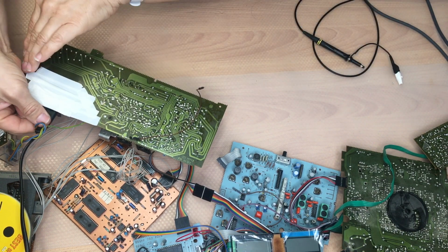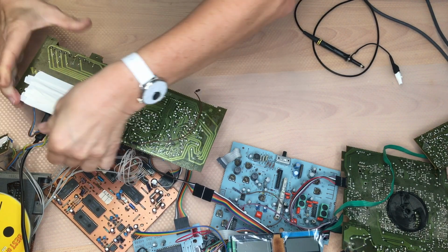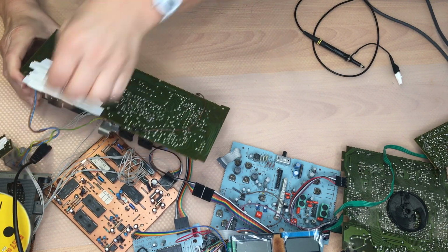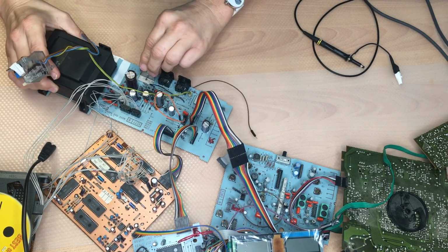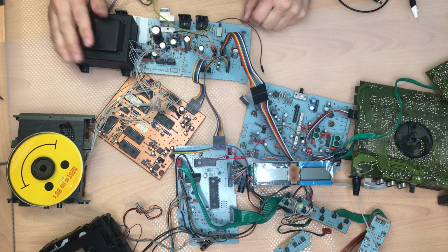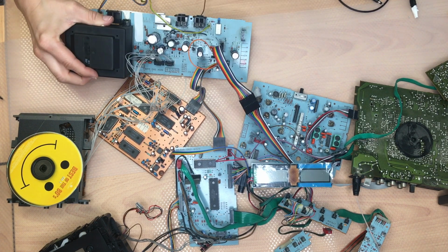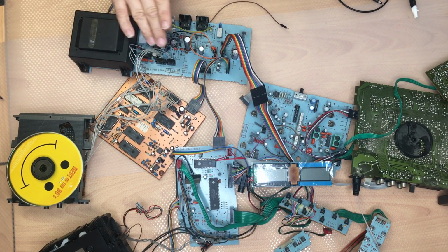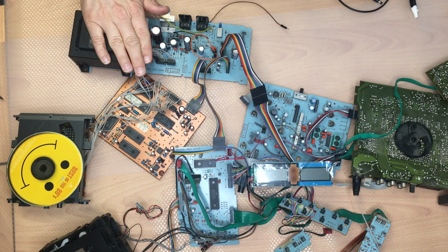Do not enable. Don't switch on the machine and stay too long in the CD mode since this little fellow is getting very hot. That was the power supply panel. I'm going to remove my ground cable. Capacitors are exchanged. Everything is working on this panel.